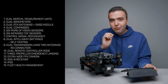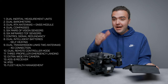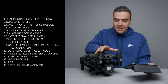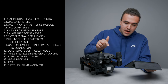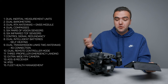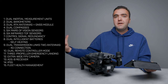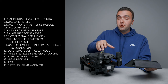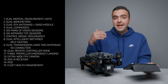My favorite safety feature is the three-propeller emergency landing. If the drone loses a propeller or motor, it can go into a controlled downward spiral and land safely without damaging itself or property on the ground — I'll link a video of the M300 doing this in the description. Additional safety features include the wide-angle FPV camera as a backup viewing option, an ADS-B receiver to detect manned aircraft with positions shown in the Pilot 2 app, IP55 waterproofing, and the fleet health management system to verify all sensors are operating properly before flight.